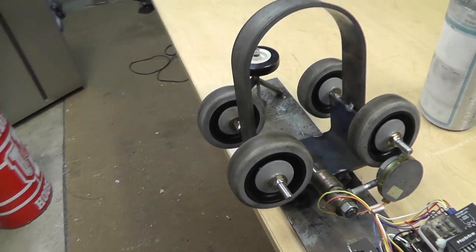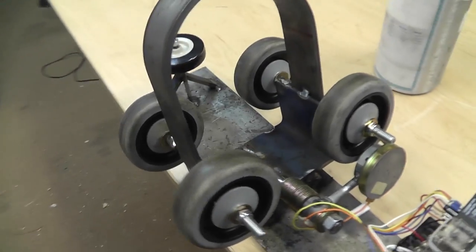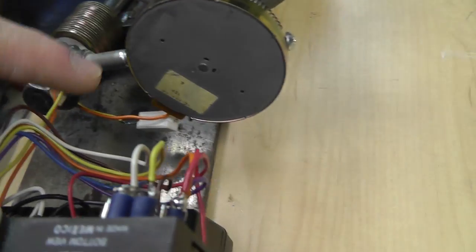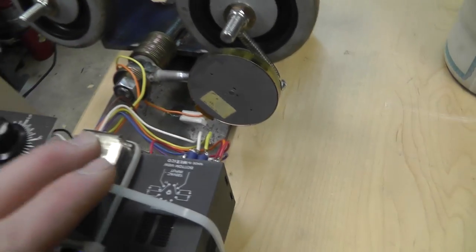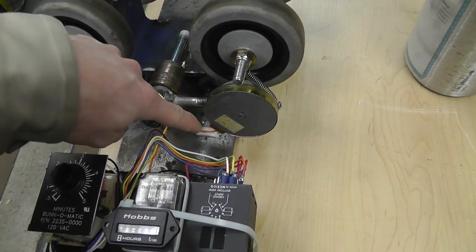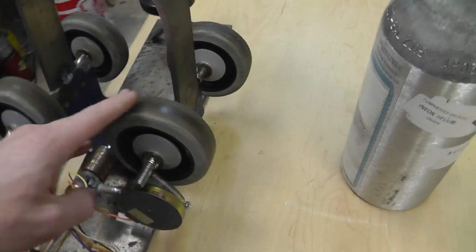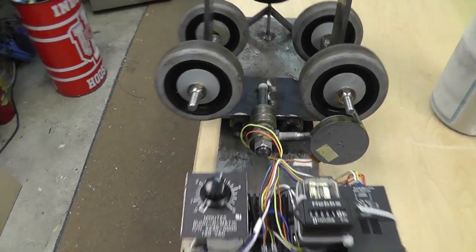All this stuff is recycled material. These wheels are old casters — pretty nice ones but without bearings. Since I'm running at a pretty slow pace, I'm not concerned. I have a resistor on this motor for two reasons: I don't know the voltage of the motor since the sticker is ripped in half, and when the polarity switches it slams hard into reverse with no gradual slowdown. This resistor dissipates that as heat, allowing the motor to slowly turn one way then the other without ripping itself apart.